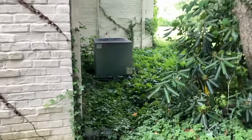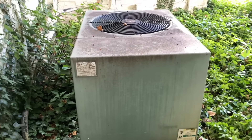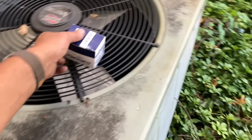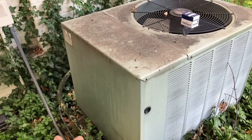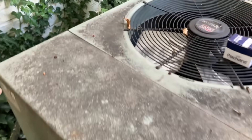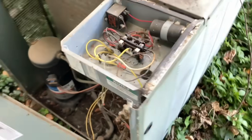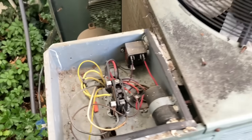It's been about 26 hours since we uncovered this unit — really frozen solid. I just turned on the switch on top of the air handler, that gave us 24 volts and blower motor operation. My thermostat has a call for cooling. We're going to take off the front cover and see what's going on. Yesterday we did manually pull that contactor open.